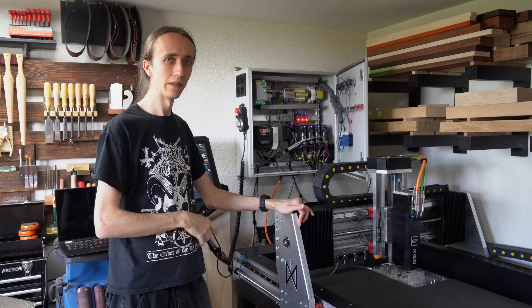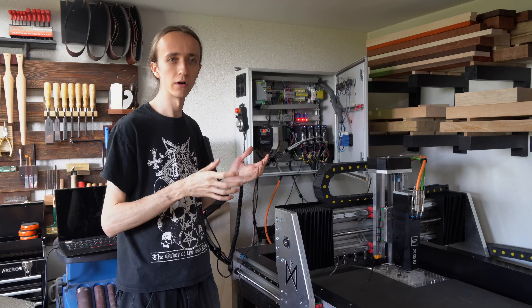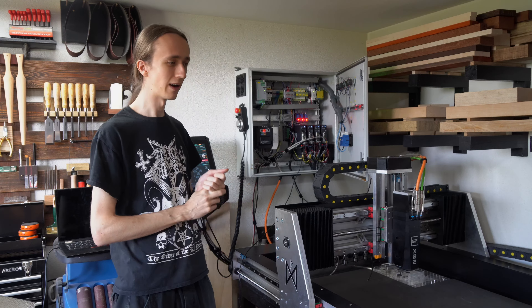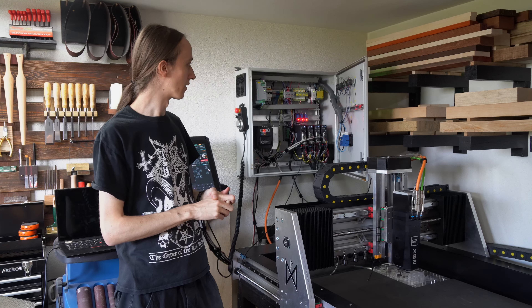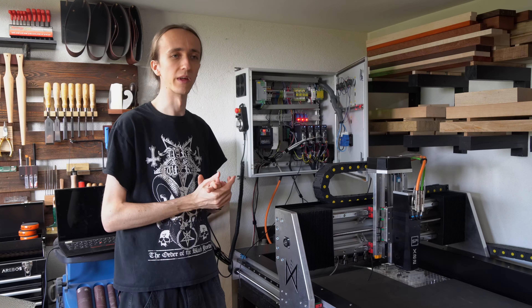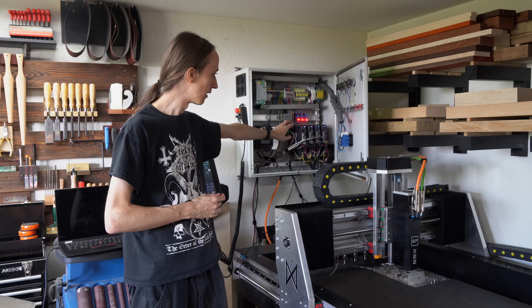According to the manual, you should wire the power for the servo drives through a line filter and a contactor. The line filter filters out dirty power or spikes, and the contactor is more of a safety thing. I was a bit lazy and did not install those two. I am going through a properly dimensioned fuse for safety, and there is a big on/off switch which is my contactor in a way. The guys from LeadShine seem to think it's perfectly fine done this way - it's not going to explode or anything.